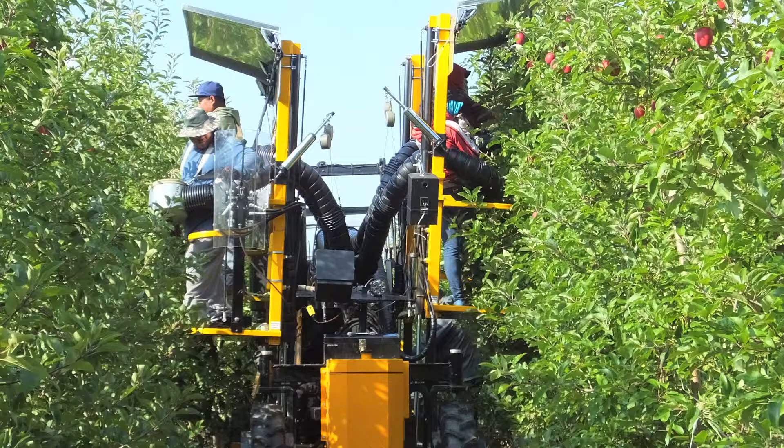It looks like it's worked real well. We took about 18 feet off the total length by eliminating the tractor and the drawbar, so it's allowing us to turn alternate middles on as little as 10-foot spacing here. We're picking the whole top of the tree from one side — alternate middles picks the whole top of the tree.